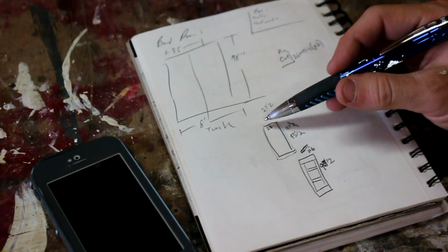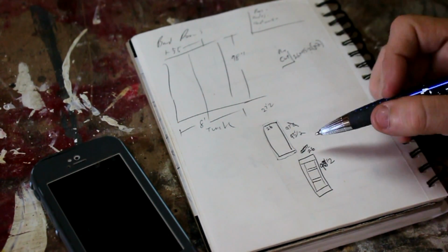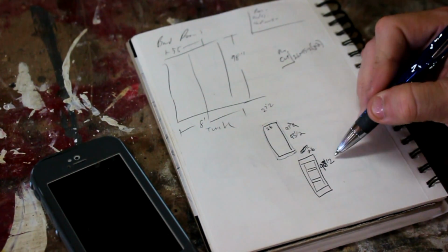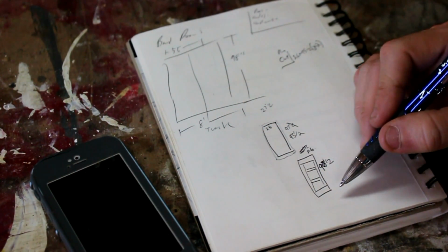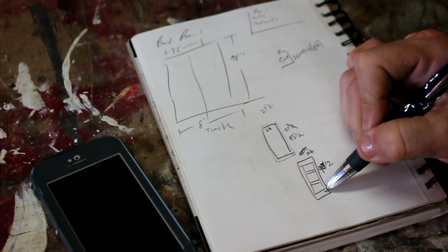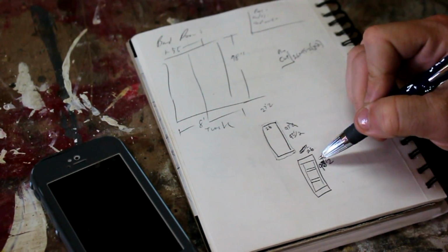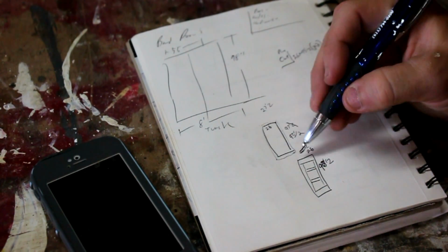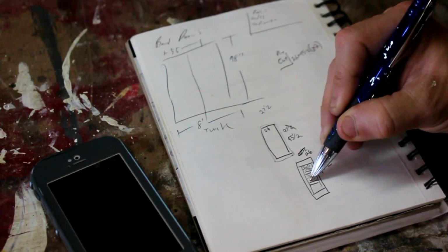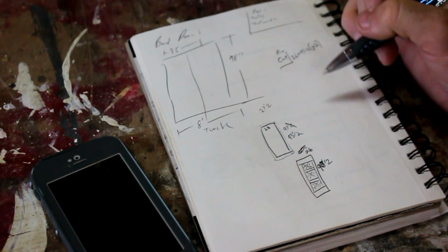So once we know the frame that goes around the outside, I can actually start working on the inner faceboards here. So I know that we have 26 and 95.5 as our maximum dimensions here, so to make that fit, I'm going to do 1x6s on the top and bottom, and 1x3s going up and down the rails here, and as the stile's going across the middle that way. I'm also going to use 1x3s to make my cross members this way, but that's going to be one of the last steps that we do as far as this whole face frame goes.